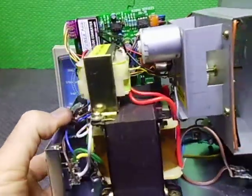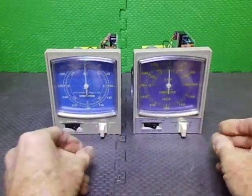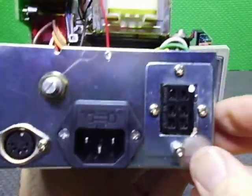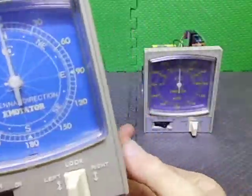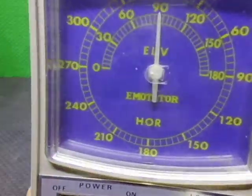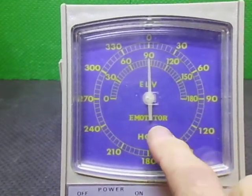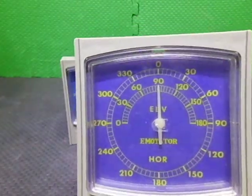The next task is to do the actual rotators — I've already started on the EV700 elevation rotator. Now the other controller is basically a duplication — exactly the same thing. It has the DIN socket out, IEC socket, and the six-pin cinch socket on the back. This one has a 360 display, where the other has a dual display. I've put a cardboard cutout in white behind it so when the lights are on it'll only illuminate the elevation part of the display.